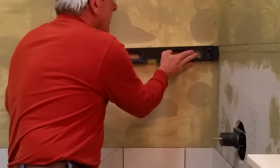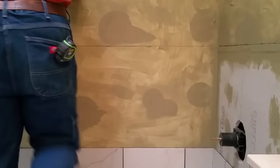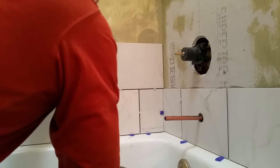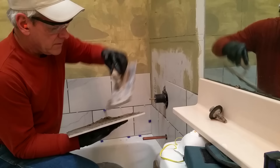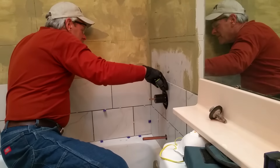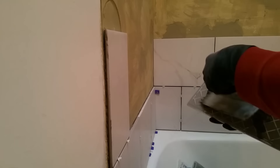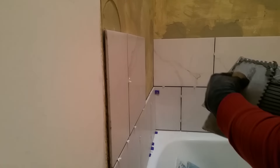In order to keep the tile aligned in the corners, make sure you install all three walls of tile as you move up. Don't make the mistake of installing six feet of tile up one wall and then coming back trying to line up another six-foot section with the first. You don't have to have a laser to do this job — they're not that expensive anymore and really do come in handy, but an accurate four-foot level will accomplish the same job in a tub surround situation. As I continue adding tile I'm using my spacers to maintain consistent grout joints, but once I get to the next level line I'll adjust my grout joint spacing below if needed to make sure my tiles line up with it.